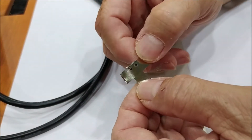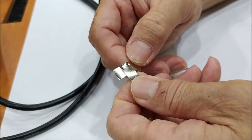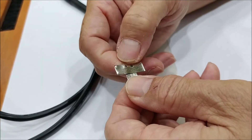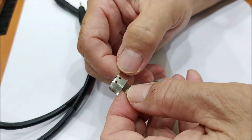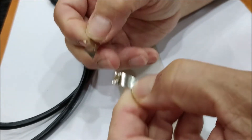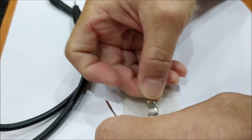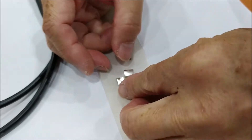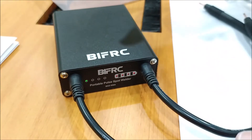After the weld, this is how it looks. On the front you can see only two indentations, and on the rear it looks like it's been burnt through with a high current. To test the strength, you can just pull it apart. If it comes apart very easily, you can try increasing the power of the spot welder to find the best power level to complete the weld.